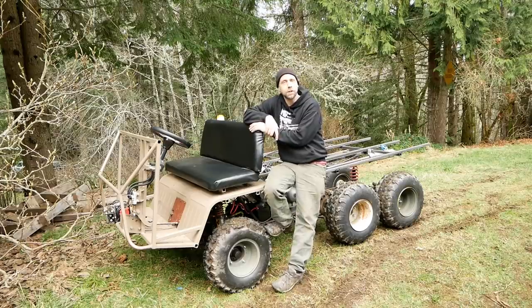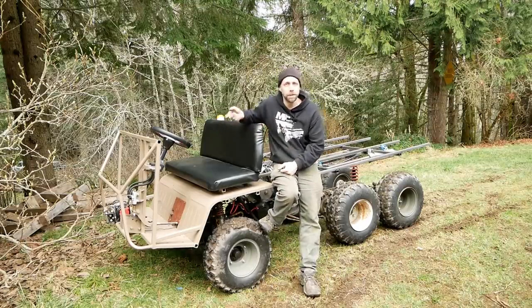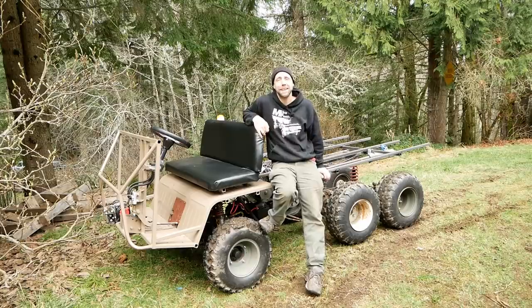So I felt a little rushed to get this last little bit of the video wrapped up. But in the next few weeks, I should be able to sort out all these little teething issues and get this thing running proper. Well, another thing is I got to get these front hubs so they engage. I need to wire them up with a toggle, because right now just the two rear axles are live all the time, and with no weight over the back end, it gets hideous traction.